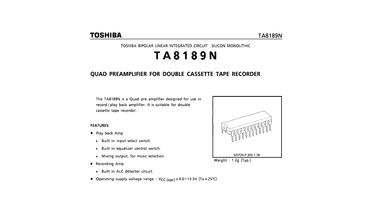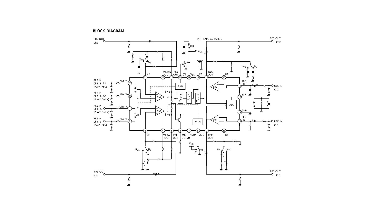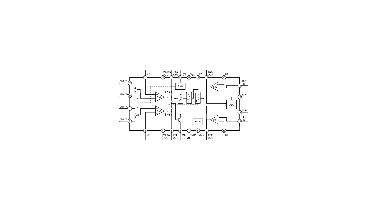With any luck you will be able to find the datasheet of that circuit. What you have to do now is to find out which of the pins are the output pins and which one is the ground pin of the chip. Somewhere in the datasheet you will find some kind of block diagram — here we have a diagram that also includes some typical peripheral circuitry — but we have to focus only on the pin outs. You can see that pins 5 and 20 are the two outputs, and on another page in the datasheet you will find the pin out of the actual package, in this case a dual inline package, and here I've labeled pins 5 and 20 as the two outputs A and B.